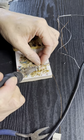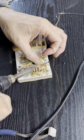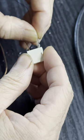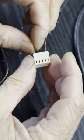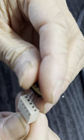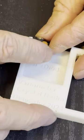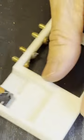Next, we need to prepare the pins for our detector socket. I'm using a 5-pin socket, because there are 4 pins for the MOSFET and 1 more pin for the diode. My detector is called 3DQ, it's a MOSFET. So let's try to fit it in. To remove the high frequency component, we will solder a 4700 pF fixed capacitor in parallel with the audio jack.